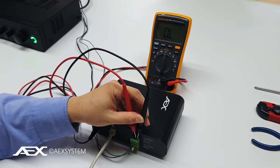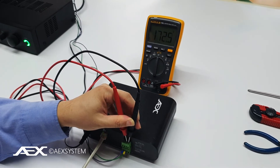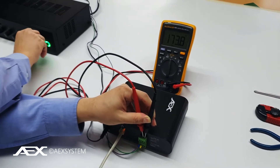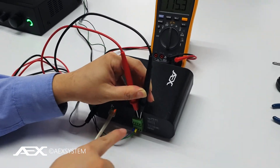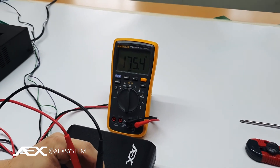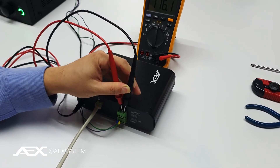We'll demo now — we'll wait for the Azan Call. So when the Azan is playing, the opto-isolator dry contact will be about 175 ohms, and you can use this to power up a relay or mute any PA system that you're using this with.